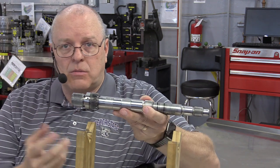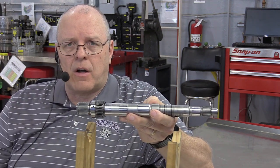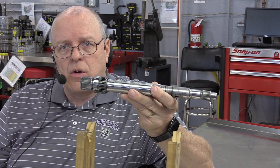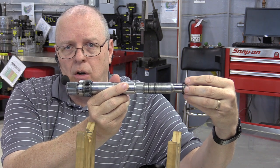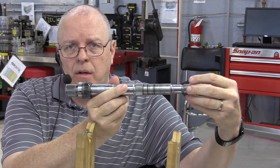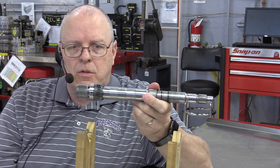We've got the input shaft, which is really the only shaft of this transmission other than the idler shaft and the final drive — all nine gears are accomplished through this shaft. The splines over here connect to the turbine and the torque converter, and then the shaft is essentially the rest of the transmission.